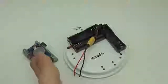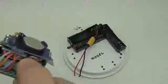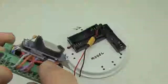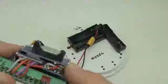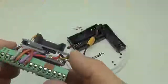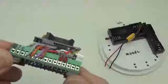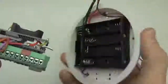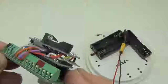As you build the more complicated versions, I talked about shutting down the SD card. This one just has the SD card running right to power and ground, so there's no disconnect on the SD. But if you disconnect the SD, you move the current down. If you change the way the RTC is powered from the default, which is about 0.1 milliamp, to running it off of a pin power source, for example, again you pull off about 0.1 milliamps. So you can bring these loggers down to really low currents in the 0.03 range, and one of those would run for 4 to 8 years on this many batteries.